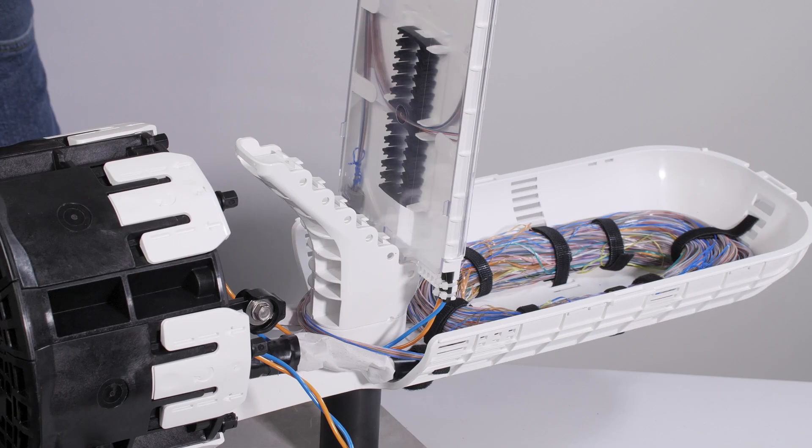In the case of hybrid fiber splicing, the ribbon or spiderweb ribbon should be secured in the center of the basket. Route and secure the loose tube on the upper edges of the basket to prevent damage to the lower bundle. This is the same for all types of branch fibers. The APEX inner cover can also separate two groups of fiber — ribbon and loose tube cable, and backbone and drop cables. All basket tabs must be removed.